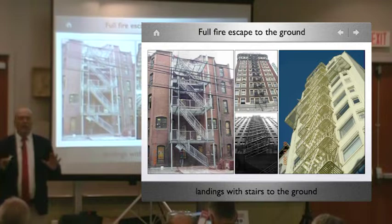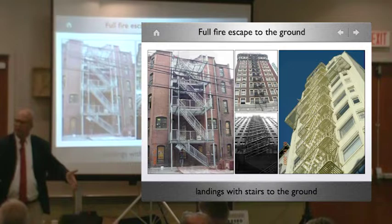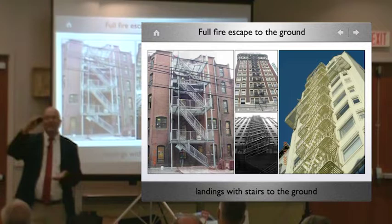And what he's saying is a fire escape usually handles one egress, third floor attic space, and you create some sort of fire escape. There's no ladders, ladders are not allowed, and they must be a full set of staircase, maybe 2 feet wide. Right. So fire escape for one of the three stories, because the other two stories have an internal full means of egress. You're coming from the third, picking up the second, picking up the first, and a lot of times egress is going to be 36 inches wide, 7-eleven rise and run all the way around.